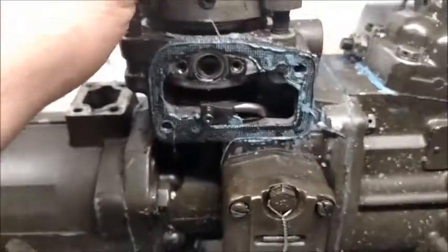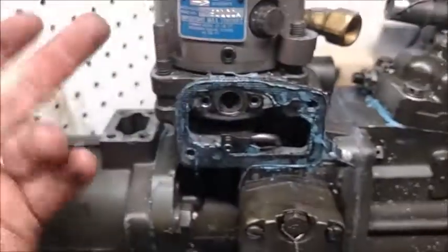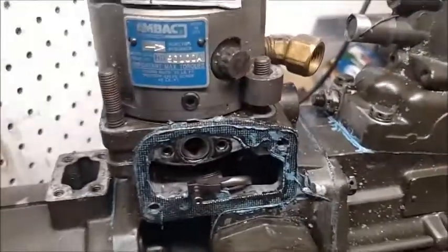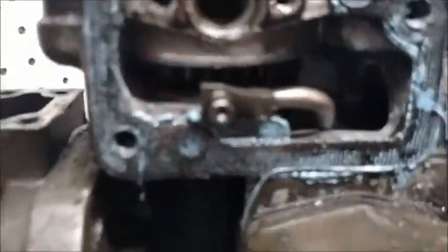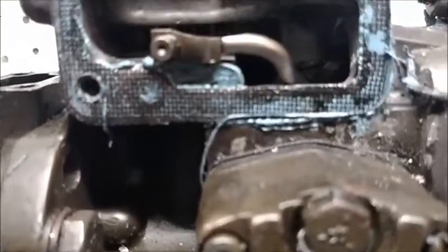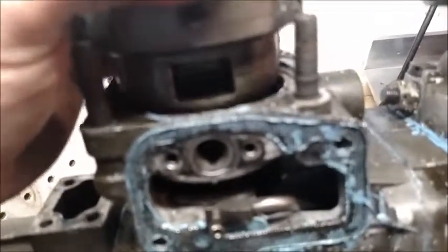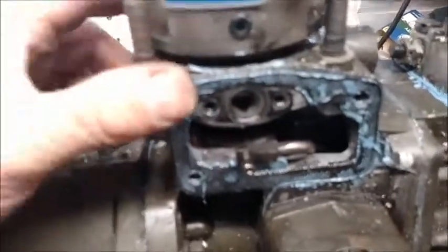You can see it's coming out right now. Do not start putting screwdrivers or pry bars under here to pry this out — if you do, the head's not in the right position. As long as it has popped up like this, it will come out the rest of the way. Verify your position of your tooth — we know the pointer is in the valley just in front of the scored red tooth. And there we go, I got that cap off. A couple of wobbles and look at that, the head comes right off. Now you can see that red tooth all the more. If I spin this head all the way around, it will not go back in no matter how much I try to force it. So keep in mind: that head will only come in and out if that tooth is lined up correctly with the pointer.